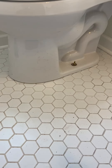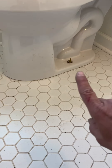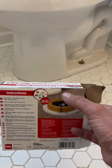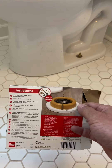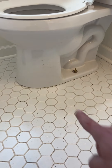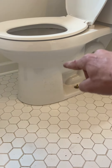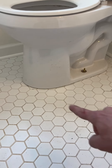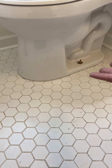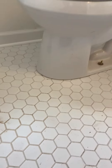Now if you want to, you can caulk that line between the toilet and the floor, but two things. One, it should be entirely cosmetic — water should never go anywhere except straight down from the toilet through the wax ring into the drain. Number two, I wouldn't caulk it until you flush the toilet at least once and made sure that water is going down exactly where it's supposed to, because this will be the only indication that you have a leak. If you caulk it, the water won't get out and it'll just slowly rot through the floor and cause issues down below.